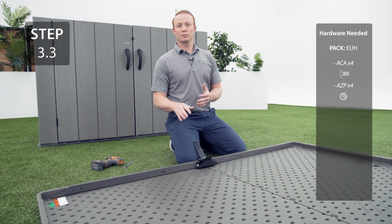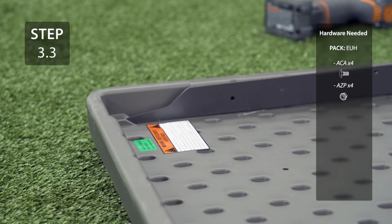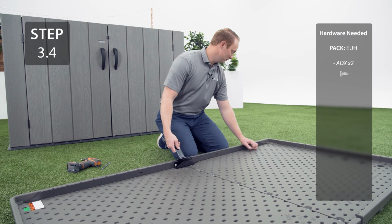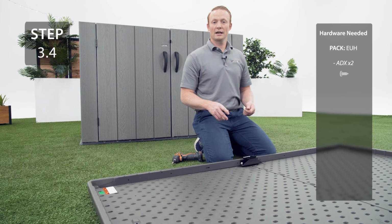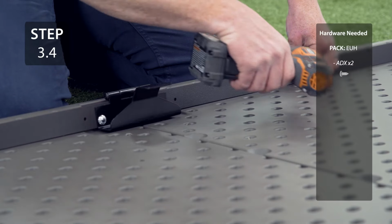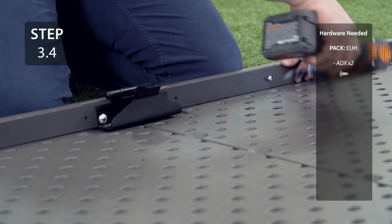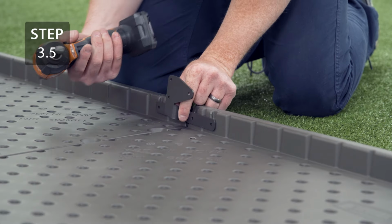Place the left end of the support into the cutout on the lid. Lay the support down and place the right side into the cutout. Slide it over until the keeper is in the center of the roof panel. Loosely add hardware to the oblong holes on the lid support. Opposite the keeper, secure the bracket oriented like this.